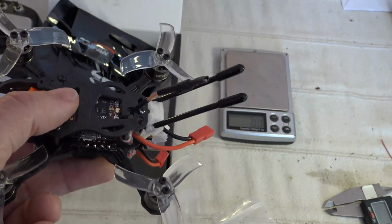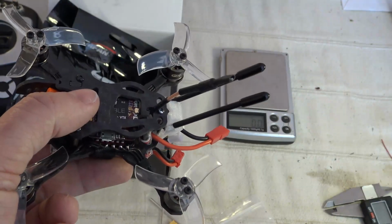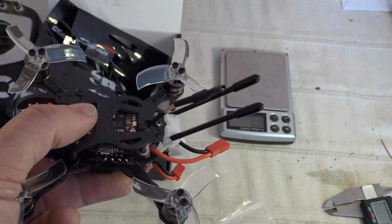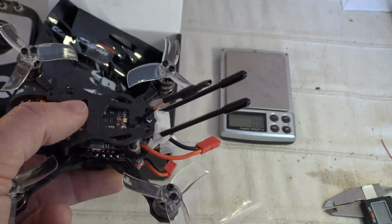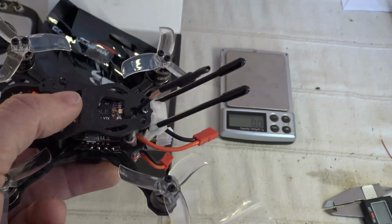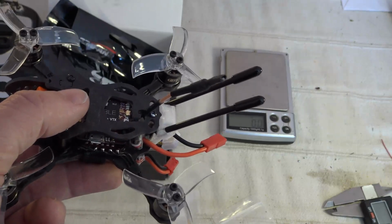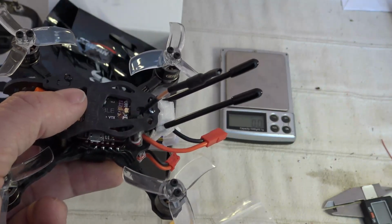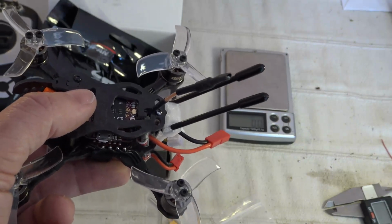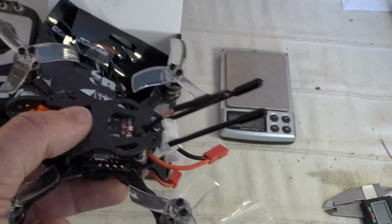now you will go into the V-band selection, and now the LED here will flash in green. So you have 5 supported bands. I said 48, but it's 40 channels on this, sorry. So one more time, when you see the green light flashing, one short press will go to the next V-band, and one green flash means the first V-band, 2 flashes the second, and so on.